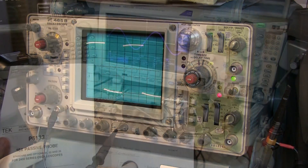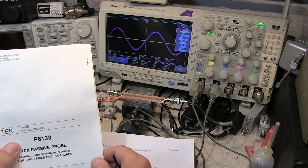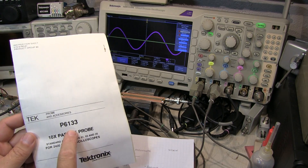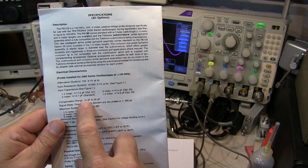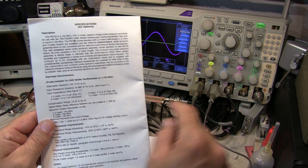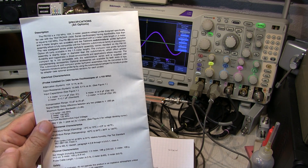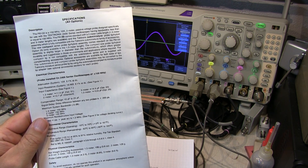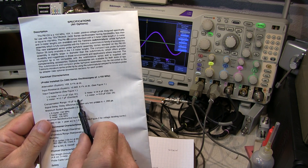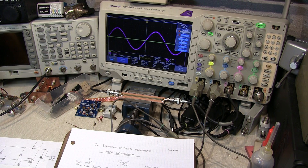This is an example where a high bandwidth 500 MHz probe is not going to be better when used with a lower bandwidth scope, so you do have to be careful about that. It's important to take a look at the specifications for the probes you're using — like these P6133s — and check what the rated compensation range is for that probe, to see if the input capacitance of your scope falls within that range. If it doesn't, you won't be able to properly compensate that probe and you'll get inaccurate amplitude measurements and possible signal distortion. So if you're shopping for probes for your oscilloscope, make a note of your scope's input capacitance and check the rated compensation range for those probes. Thanks for watching — please subscribe if you haven't already, and if you liked this video give me a thumbs up.